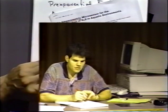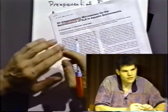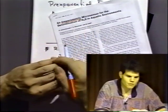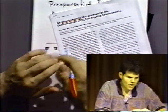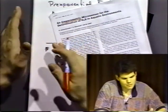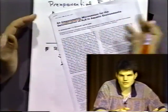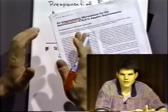Some sensors, particularly pH sensors, are not amperometric — they're so-called potentiometric sensors. A potentiometric sensor measures potential. This one measures current. Amperometric current measurement sensors often have to apply a voltage to polarize the sensor to get current to flow. Otherwise we would just sit at the equilibrium point and not get any current flowing.